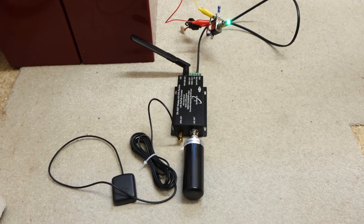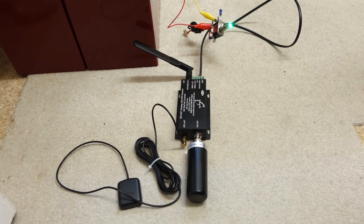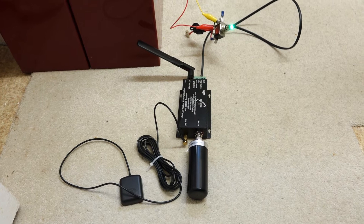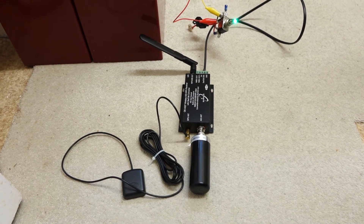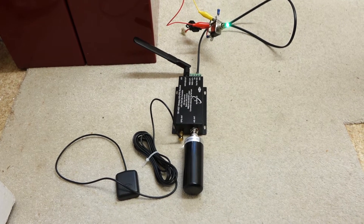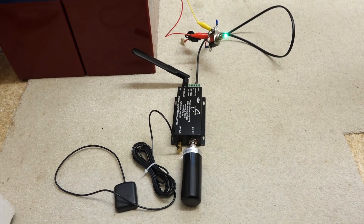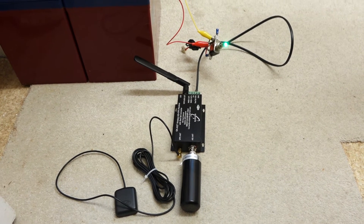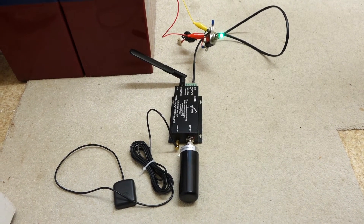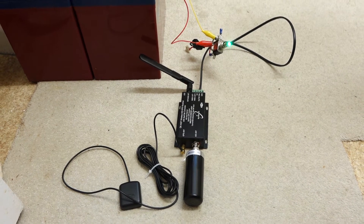If you're using your VHF, it's useful to just switch this thing off so it doesn't receive anything whilst you're transmitting on the VHF. Otherwise, you apparently need to separate the aerials one meter vertically and two meters horizontally. The only damage that can happen is if you're transmitting, and the short amount of time you're transmitting, just turn it off — because at that point you already know where the ships are; if you're talking to them, you're looking at them.